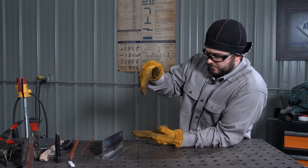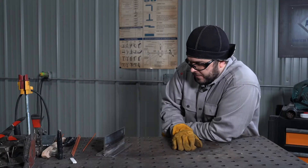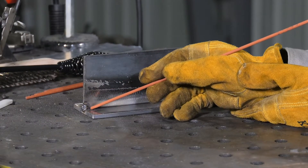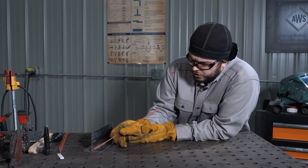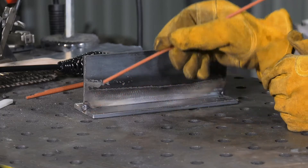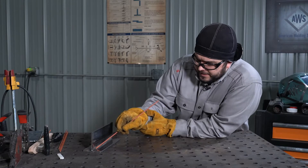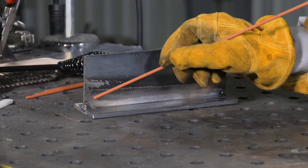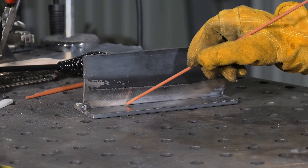Here's the T-fillet weld — two pieces of material meeting at 90 degrees. We've got a quarter inch. I've gone ahead, prepped it, removed the mill scale and we're going to weld this up with some E6010. We're going to strike this arc off the tack, maintain a drag motion and really concentrate a majority of the arc right down in the root, and make a slower circular pattern watching so that the weld pool builds up and catches both the bottom plate and the top plate. My work angle, I'm going to try to favor a little bit more heavy on this one — about 45 to 30 degrees pointing it towards the top plate. Travel angle, I'm going to keep it about 30 degrees and make that little circular motion as we move across.